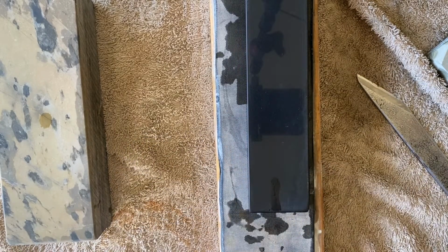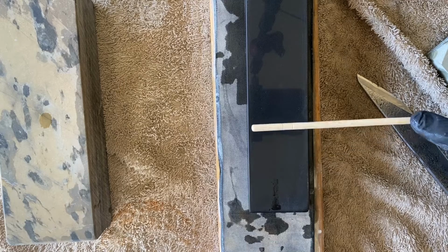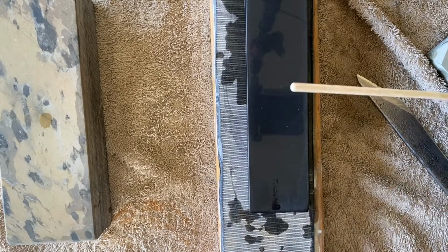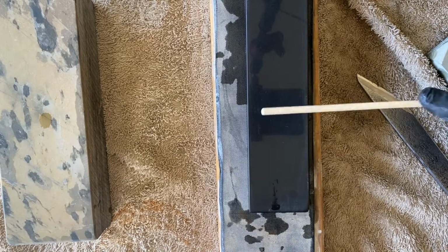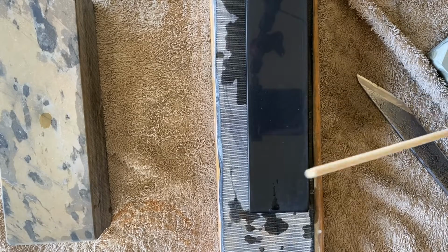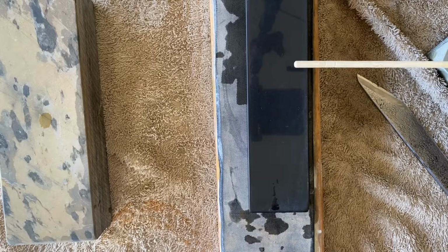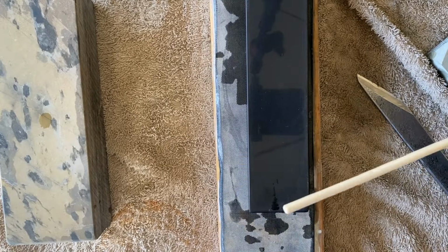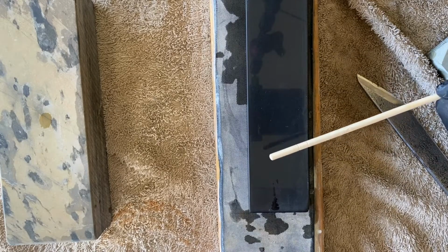Stone maintenance is the other one. There's various ways of doing it. People like them 200 grit, other people dress them at 1000 grit. There's no right or wrong. Play, experiment and see what works for you. People will prefer convex stones. Some people prefer flat stones. There's no right or wrong. If you go down a path, you have to explore for yourself and get your own experience to understand what works. Listening to somebody else's story is at the end of the day only their experience, and yours are going to be different because you've got different requirements or different needs.